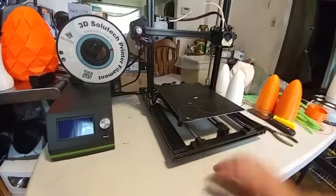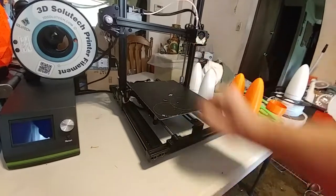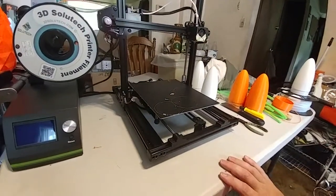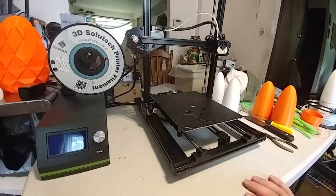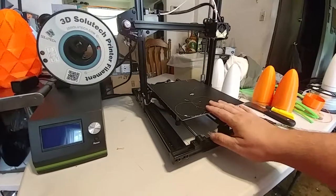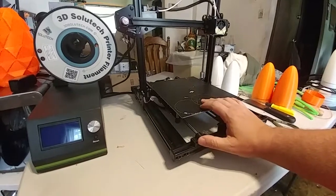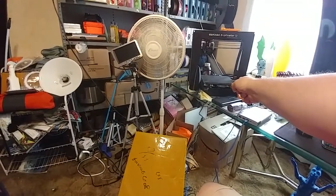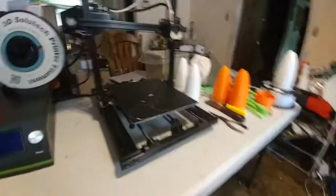All I can say is keep it up. Make a few of those upgrades, put that MOSFET in there, and fix the fan shroud — that needs to be fixed because you cannot reach proper temperatures with the fan cooling off your heat block. Great printer — contrary to a lot of people on YouTube, I really like this printer and I think it has huge potential and fits a niche in the market. It is not competition for the CR-10; I would never buy this over the CR-10, but I absolutely would buy this over a regular i3 — it's stiffer, better, and faster.